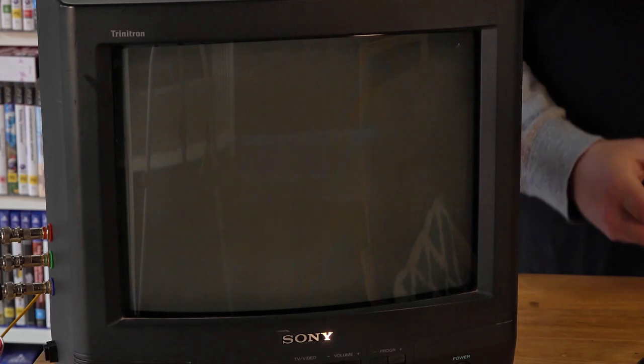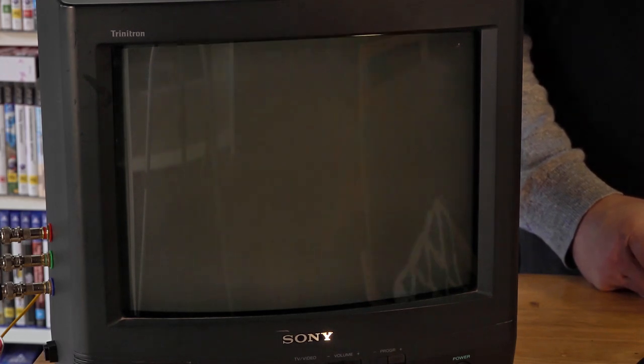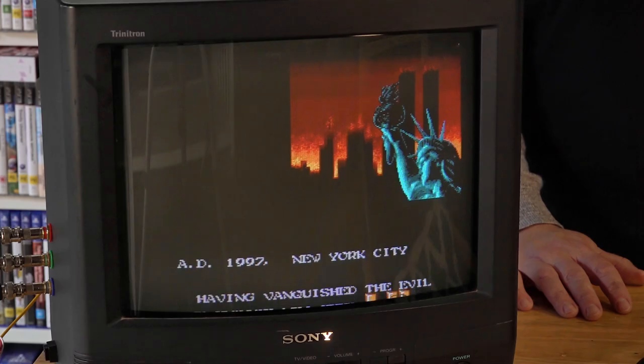I'll throw a game on here. The picture is a really good quality picture, so I'm not going to mess around too much. The geometry on this is pretty good — there's really no need for adjustment on such a small CRT. On something this small you really don't notice minor issues — if it was a 69cm CRT with bad geometry, you'd really notice it. But on something this small it's just not worth spending hours getting exact convergence right or adjusting a yoke tilt — once you're playing a game, you don't notice it.